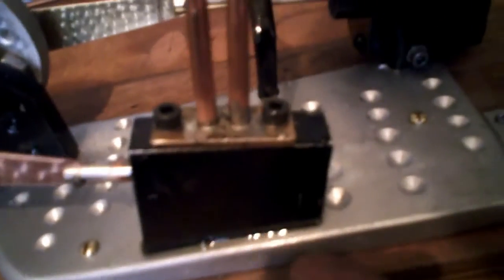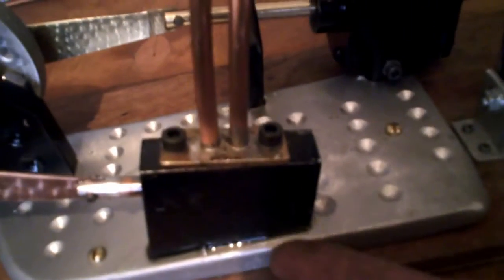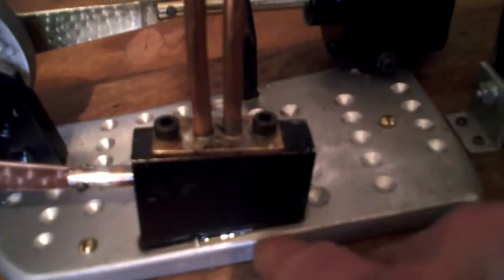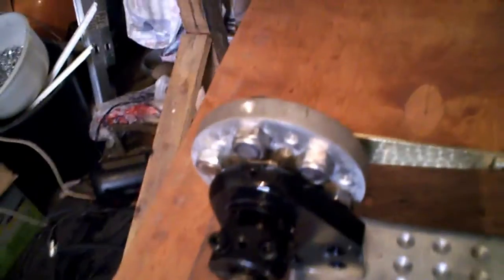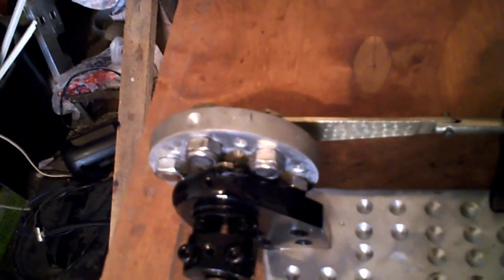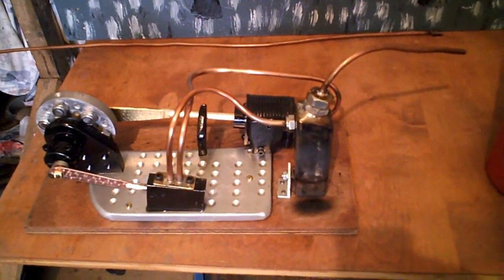So it's all there and polished up, and you've seen it run. And so we'll have to just go and see what happens. It does need a gasket in there, it's leaking very slightly out there. Also, when I drilled that screw, I just touched into the spool valve chamber. Well, I did seal it a bit, but it's still leaking very slightly out the bottom. It's nothing much, and as long as you've got enough pressure to overcome it, obviously the spool valve leaks. So anyway, we've spared you the torture of watching me do all the polishing and oiling up. I've done all that already. And so we'll go outside and just see what happens.